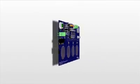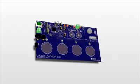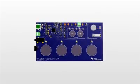The DRV2605 EVM CT is a complete demonstration and evaluation kit, giving you the flexibility to control and explore the features of the DRV2605. The board contains the DRV2605 haptic driver, a programmable MSP430 microcontroller, an ERM and LRA actuator, and capacitive touch buttons. With one board, you can both characterize the DRV2605 on the bench and demonstrate it around the office. Let me give you a quick tour of the board to get you started.